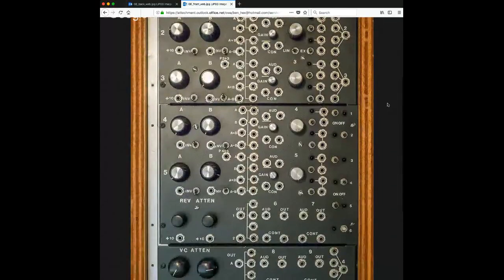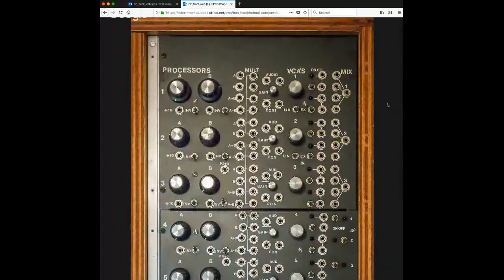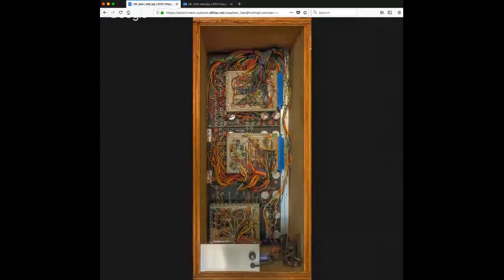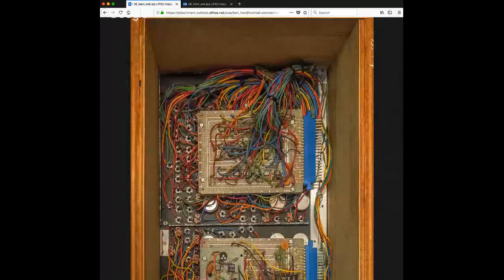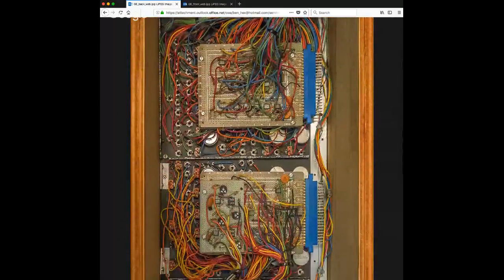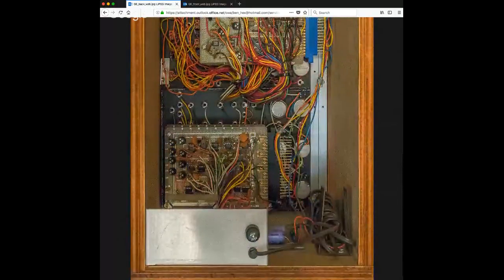so you don't overdrive something. So it's amazingly well thought of back in the day, but it's based on the old 70s Aries synthesizer. There's a whole bunch of 3080 chips in the back, and these old VCA designs only have about 70 dB signal to noise. But it still has a linear exponential switch on all of them. It has a gain and an overdrive control on most of the VCAs. It's been a massively useful cabinet. And despite being so old, I've only had to recap the power supply and spin it so far.